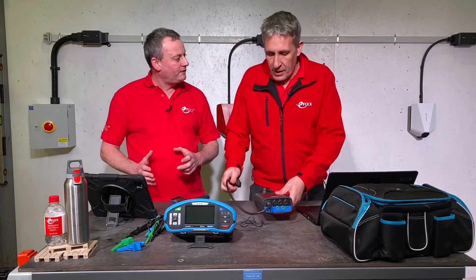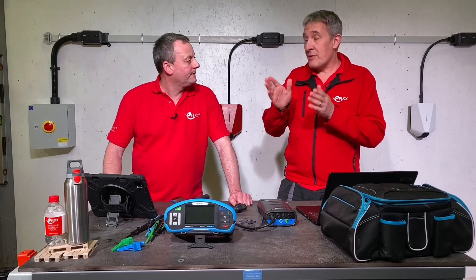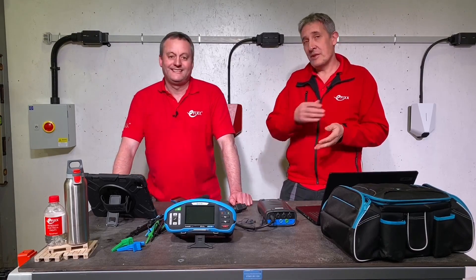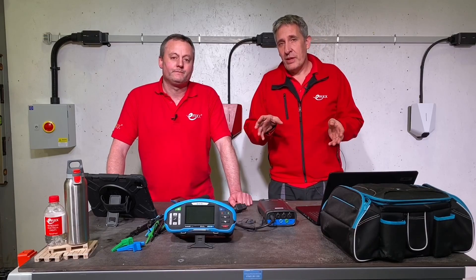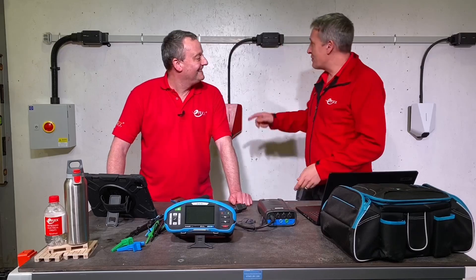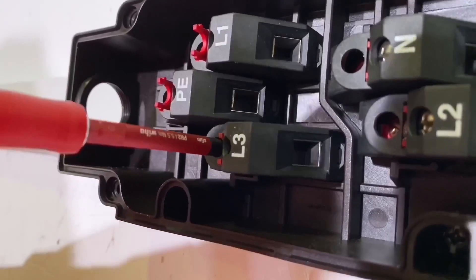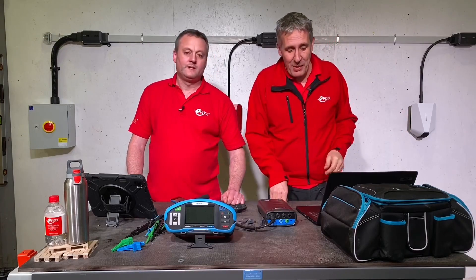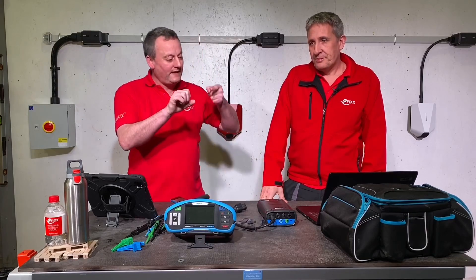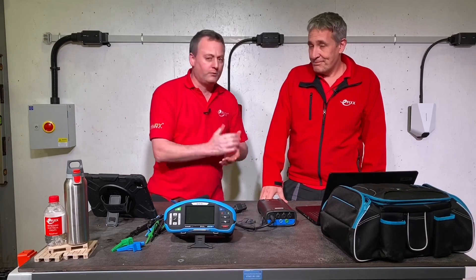We built our own test sequence - we came up with this 10-test sequence and added it into the Metrel tester. The great thing about the Metrel tester is - if you haven't seen them before, we've featured the MI3152 and took it through a whole test sequence for an EV charger, which is built in. But today for our rig we just want to focus on the insulation test, because some people don't believe this flat cable system we installed - we actually screwed through these boxes into the conductors.